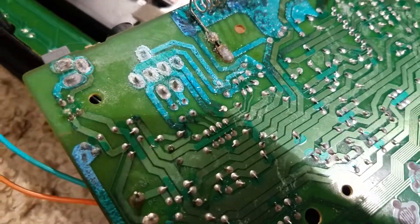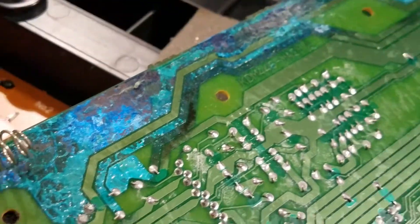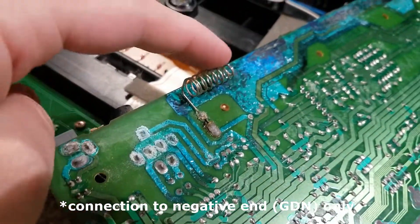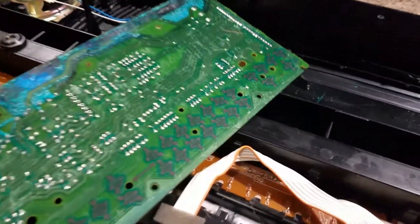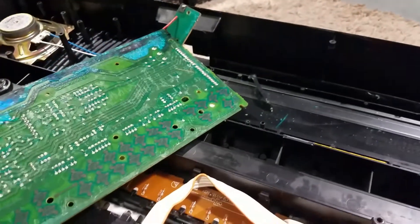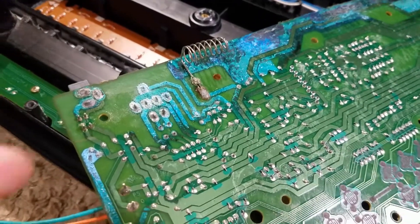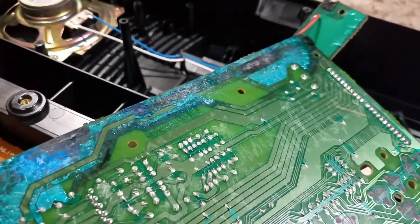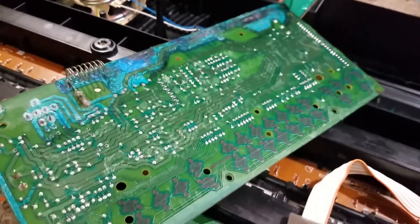Look at that, right there. So now it's not turning on, although there's actually a connection because this cleaned off really well. This is where the battery goes — it slides in like that. There are six AA batteries. The PCB is face down over here. The biggest problem is just corrosion on the traces, especially over here. That was a part of the ground plane. And it looks like we are getting connection with a battery, just not to the ground.